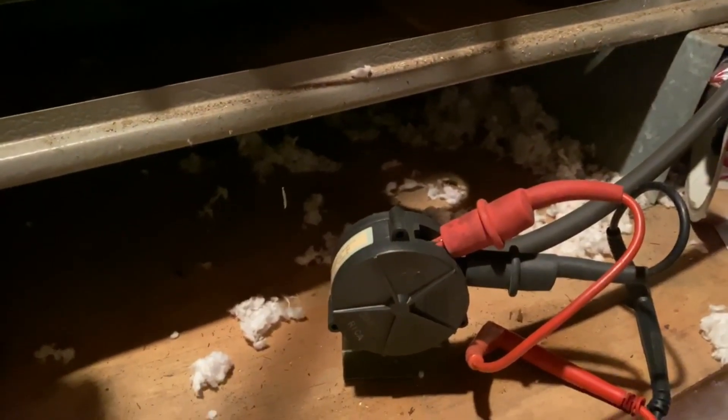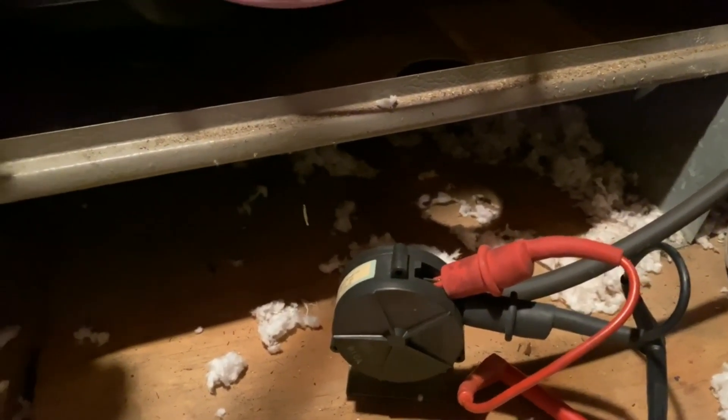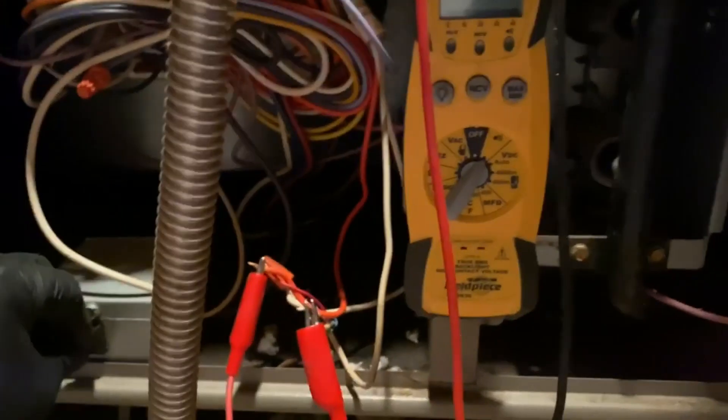We're going to pull these wires off and use our tester to make sure the wires are good, because sometimes it could just be bad wires. You want to do all this before replacing parts so you have a full picture. We're also going to test the inducer to make sure it's pulling enough pressure by hooking up a manometer. We've got continuity mode set — when the inducer comes on it should be pulling 0.35 inches water column. The pressure switch is not closing because we're not getting any continuity.